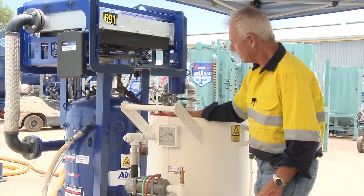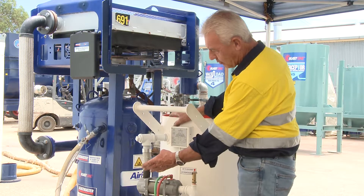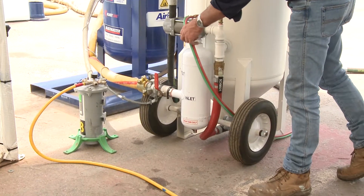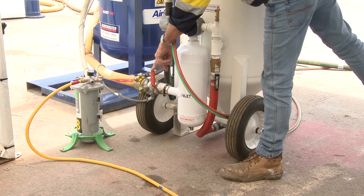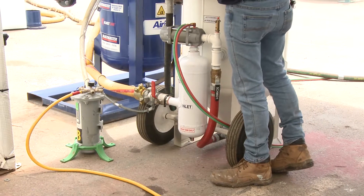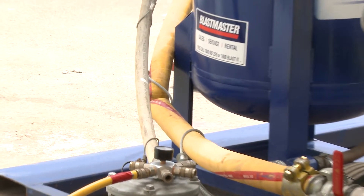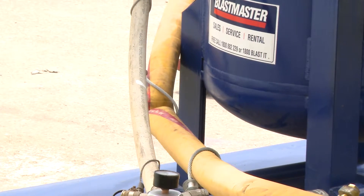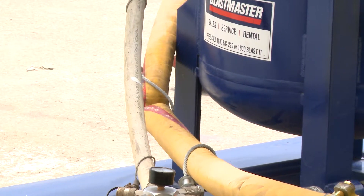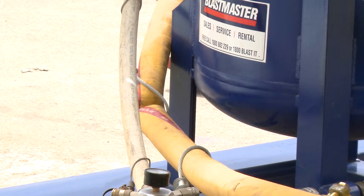So we've appropriated our gear for blasting. We have an air prep to ensure no moisture in the air, a breathing air filter — a Radex filter — a breathing air line, twin dead man connected, twin line dead man. The valve's off and the bull hose is connected. But if you look at the bull hose further up, you can see there's a crimp in the hose. When you appropriate your bull hose you must make sure this doesn't occur, primarily because it can twist the twist-lock fitting off the parent fitting and cause the hose to fatigue where the crimp is.